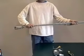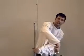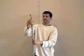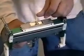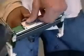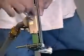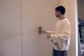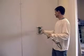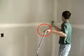For coating, attach the coating tube to the quick connect. Screw on the coater or angle head gooseneck to the tube and hand tighten. When using the flat coaters, set the coater to the desired crown by using the blade tension adjuster. Flat on the blade tension backer bar will mean flat on the wall. Place the coater on the wall, extending your tube hand over the board just like you would have a hand knife. Start down the seam as you engage the lever.